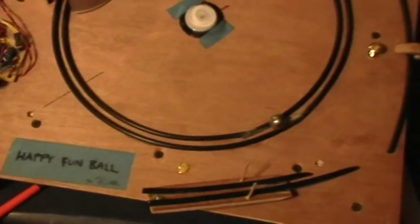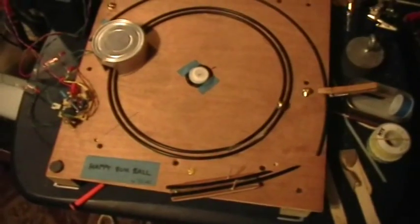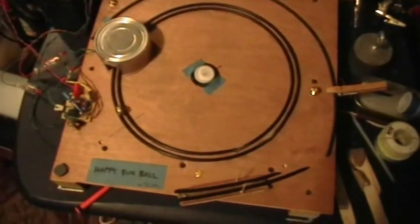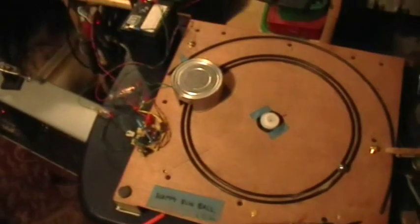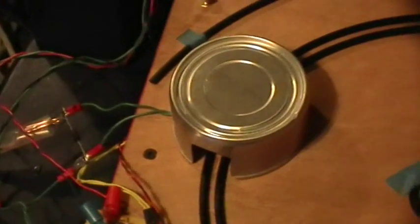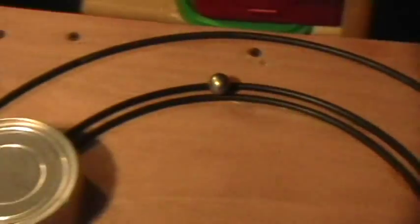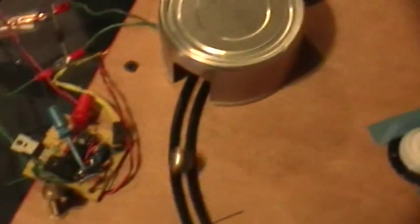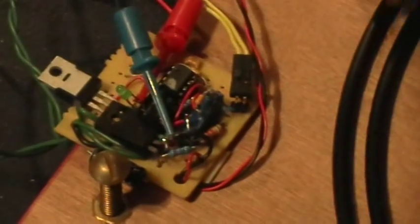It's time to talk seriously about what's going on here. What I've got is a circular track made of some plastic irrigation tubing and a steel ball running around the track. I've made the track as level and smooth as I possibly can. Over here I have a little electronics module, and inside the can is an electromagnet and an optical sensor system so that when the ball comes around, the shadow triggers the optical sensor, which then through the electronics module pulses the electromagnet very briefly. The green LED shows when the electromagnet is pulsed and for how long.